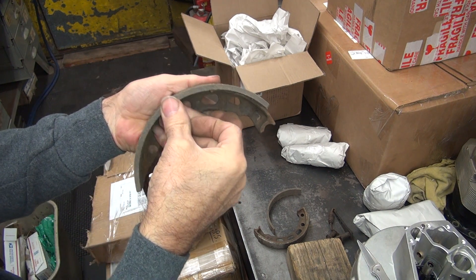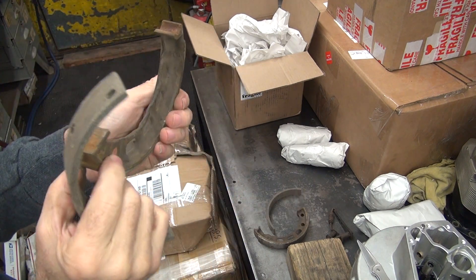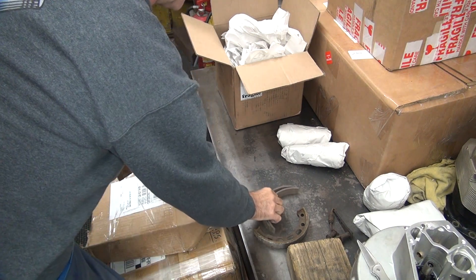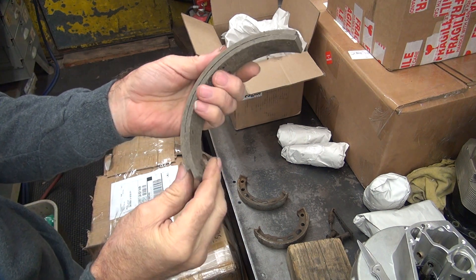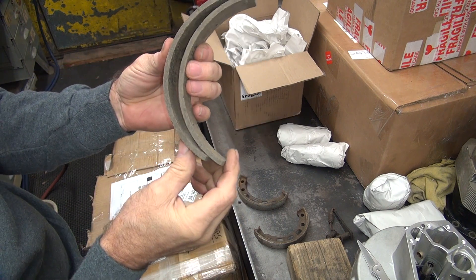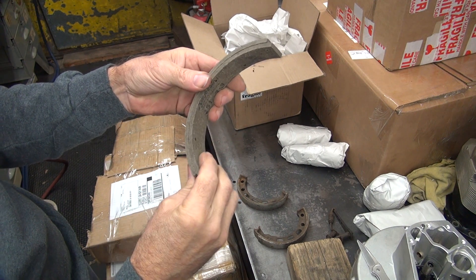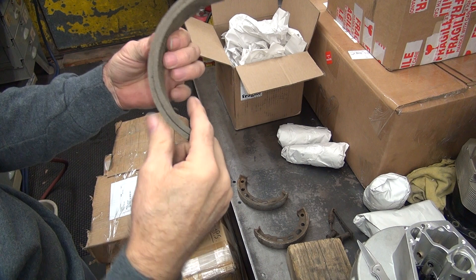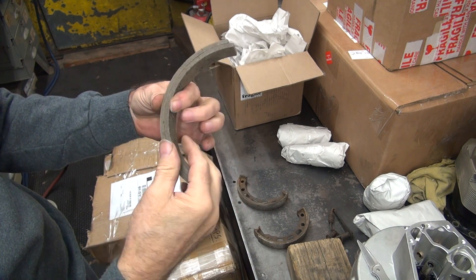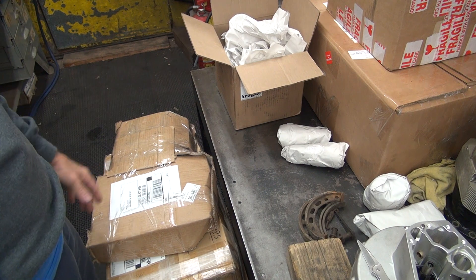The diameter is correct - see it's the same arch, same curve. So we know it's the same brake shoe. The drum diameter is the same and the width is good - it just doesn't match this shoe. Back in the day you would find a lot of shoes with double bolt patterns drilled in them to make them fit. It doesn't fit this one, but it might fit the other one. If these are not overbent, they will not match. But see how these kind of match - that means they came packed like that. See how they fit on top of each other. It's best not to force them together - you'll break them. When these things come packed up, they're all packed in paper with a little bag of rivets right in there, wrapped up in paper, is how they came originally. The ones from the 30s just had a little piece of red cellophane-style tape that went around, and the rivets were in a bag. Anyway, they're still pretty good. I like stuff like that - because when you use those, they stop. Alright, that's it for brake shoes.